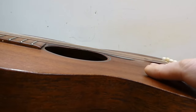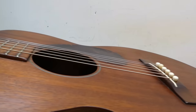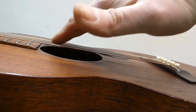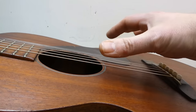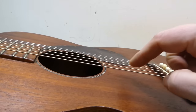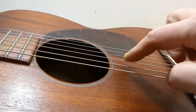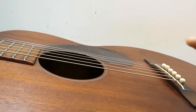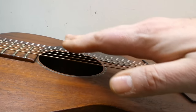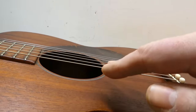Through saddles were a little bit on the lower side than what they ended up being in later years. The top on this guitar has some distortion and waviness — there's a bit of a hump behind the bridge, which is very common, and interestingly there's a hump in front of it too, around the pickguard area. I suspect this happened when the guard contracted over the years and may have pulled the top up with it.